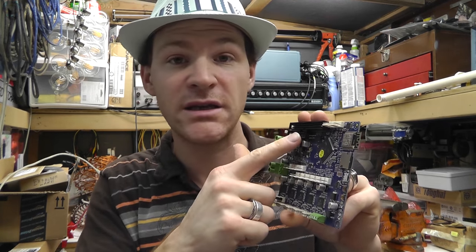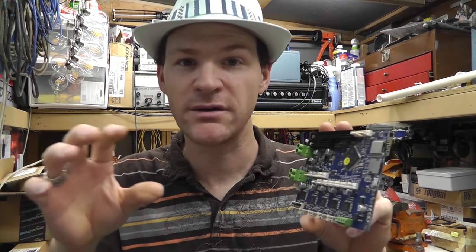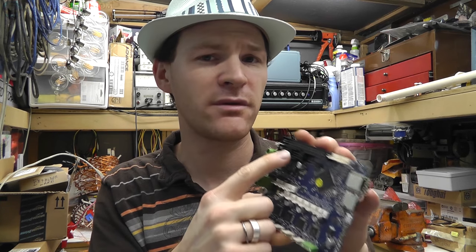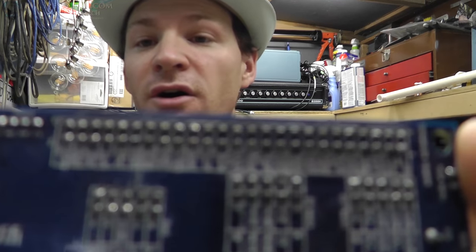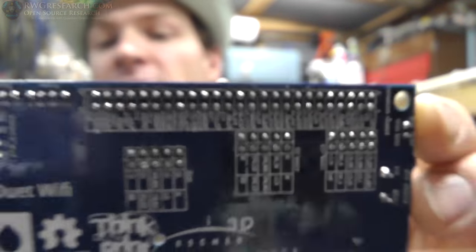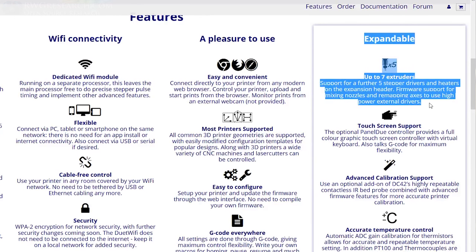There are extra pins here for an LCD display — like a 20-character 2 or 4-line LCD display like you have on an old RAMPS system — so you can still interface that here. It has an extra SD card output; I don't think the old version had that. It also has a breakout board — you can see all the different pin outputs there. That's totally an isolated breakout, so you can actually put up to 7, 8, or even more extruders on this thing, which is crazy, or extra motors for other things.